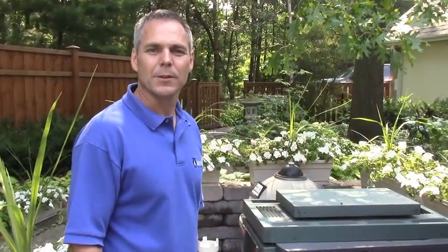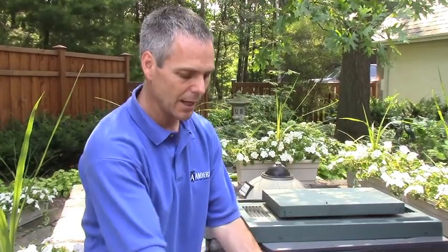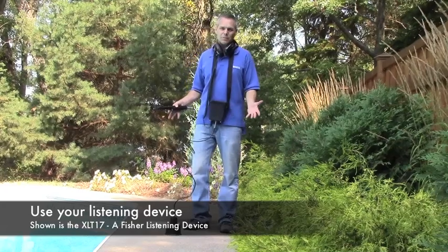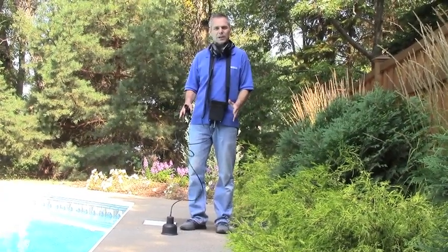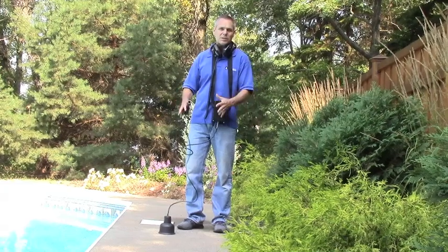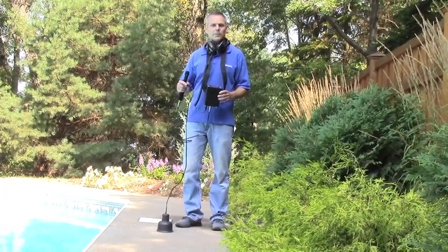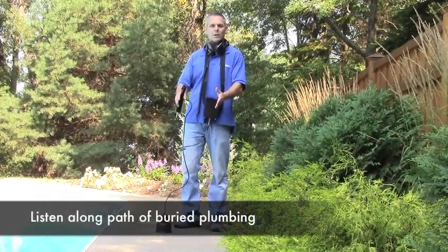Now we have our compressor turned on. We can hear it in the background, but it's not going to make too much noise when we're listening for the leak. We're at our pressure tester now. We have the air hose hooked up to the air side of the pressure tester. I'm going to turn the valve to open it completely up to that air source, so we're letting air into this leaking section of plumbing. As that air goes into the plumbing and escapes into water-saturated soil wherever that leak is, it's going to make a bubbling gurgling sound that we can easily pick up with our listening device. I have my listening device ready. The listening device has a muffled microphone, meaning it muffles out all the sounds in the air and focuses just on the sounds in the ground. In addition, the electronics in the amplifier will filter out different frequencies, enabling us to pinpoint the sound of the leak and minimize outside noises. I'm going to listen along the path of that buried line at various locations, listening for the loudest, clearest sound.